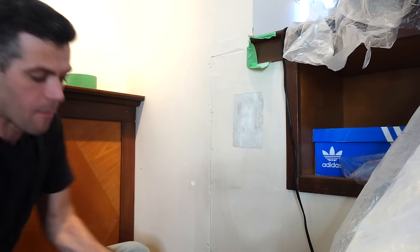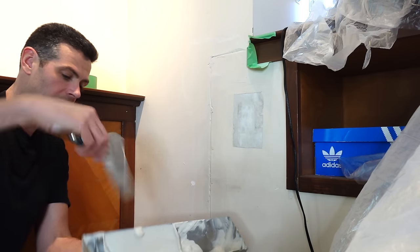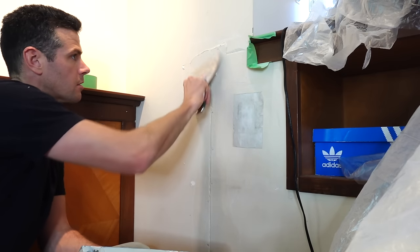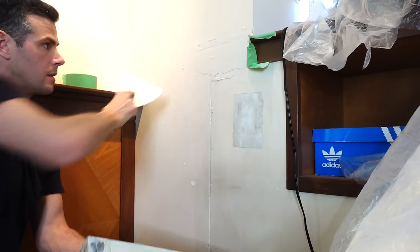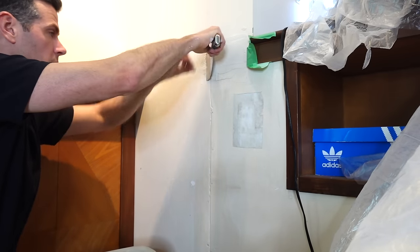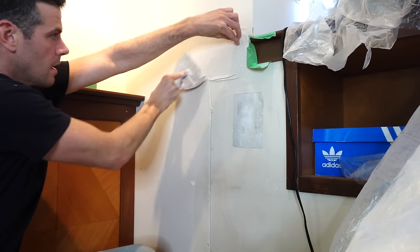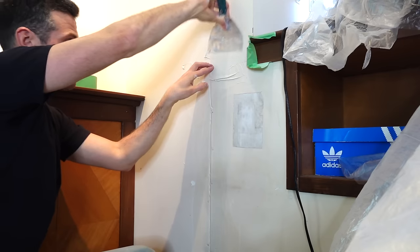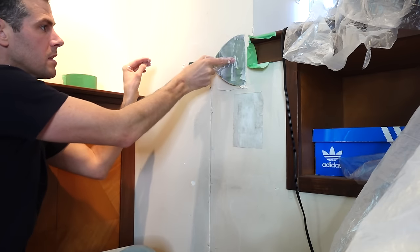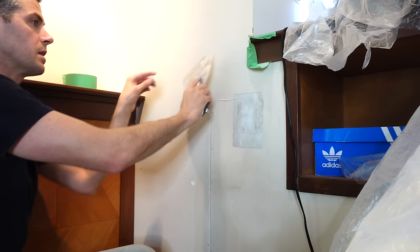One thing about using fiber fuse: you don't want your mud too thick, so even though I'd love this stuff to thicken up a little bit, I won't be able to get the fiber fuse on if I wait. You want to spread it pretty thin — no more than an eighth of an inch — otherwise you're gonna struggle getting the mud out from underneath. I'm just wiping in multiple different directions. If you have a brand-new taping knife, the sharp square edges can tear this stuff pretty easily, and if you run your knife over it really hard too many times it'll fail. So you've got to be careful of that.